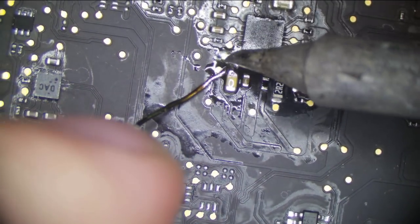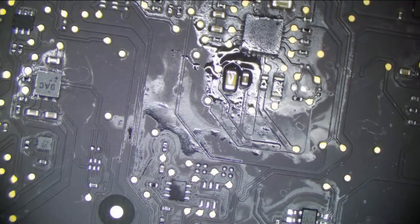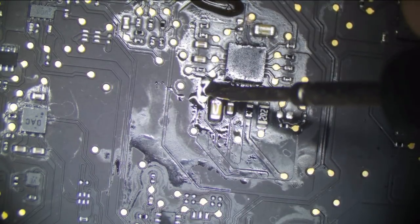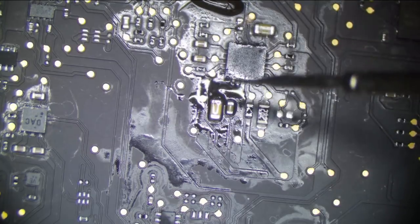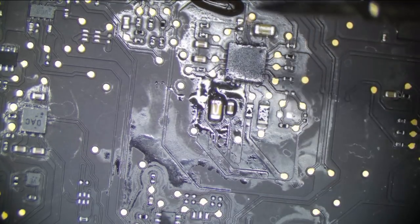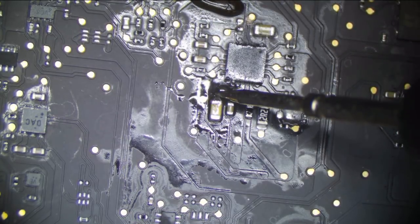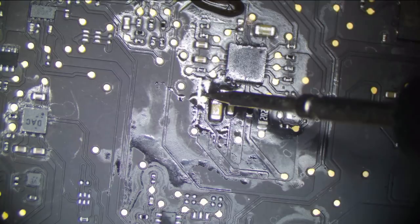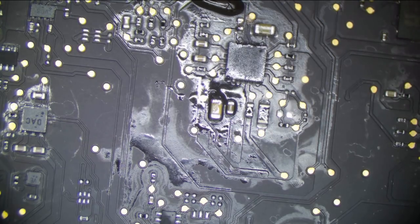We'll put the backlight driver back on. We'll put Thunderbolt back on and all that stuff. But let's see if this turns on properly and gives us V-core. So let's check and see what our resistance is right here first. So we're going to measure in ohms again, and are you still low, little board? Five, 600 ohms, that's still trash. What is going on? That is still trash.